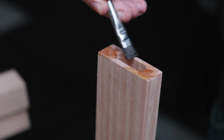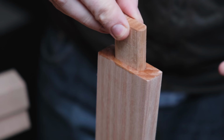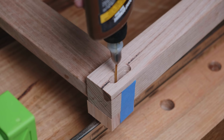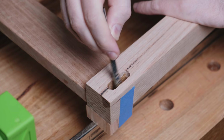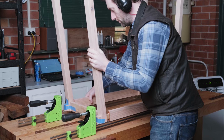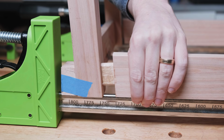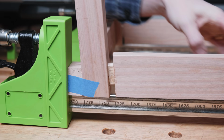The two short sides were glued up first, then once they were dry, the slightly more complicated longer aprons were glued to join the whole thing together. I've taped on angled cauls. These are just offcuts from cutting the legs and aprons down to size. The angled cauls mean I can just use two clamps to clamp up the table and they won't try and pop off the frame.